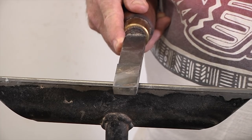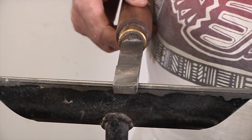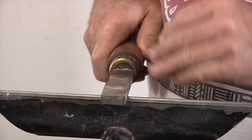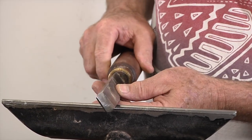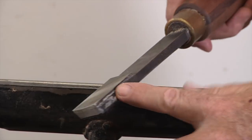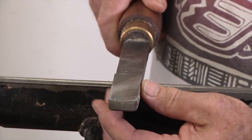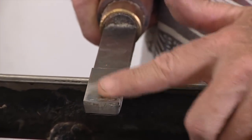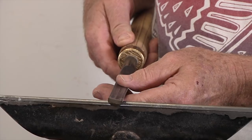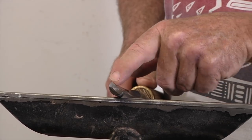Now this is another tool remotely related — this is called the Big Ugly tool. I can't really call this the Big Ugly because I actually have a wood handle on it, where the traditional version had cutters on both ends. But this has a flat surface on the bottom, so you can use this as a scraper. I do have the edges rounded a little bit so I can roll it up on the edge, and I can make some of the same cuts with this that I can with the fluteless gouge. This cutter, the metal on the top, is a piece of Tantung — it is a cast metal, almost as hard as carbide. Stellite is another metal that works. It is brazed or silver-soldered on there — very good cutting edge. One other thing I do to make sure I'm working on the lower half of the blade: rather than holding the tool level, I tend to drop the handle a little bit, so that'll keep me on the lower part and makes it impossible to get on that upper part.